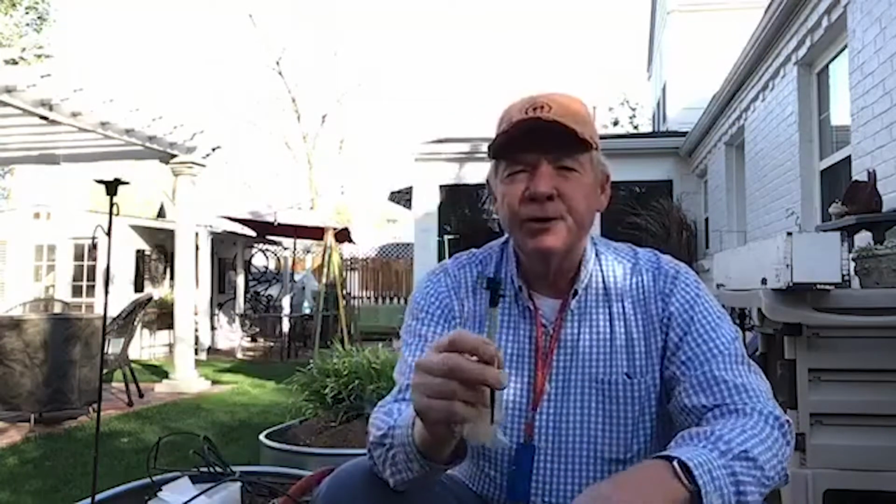That's the next size up. This is going to be an external line that's going to deliver more water and give me more of a spraying capability. Let's talk spraying versus bubbling, okay? When I use the term bubbler, this doesn't spray water all over the place. Water bubbles out, and it keeps the soil moist.